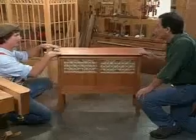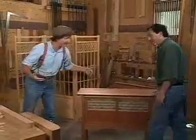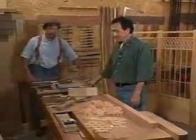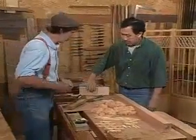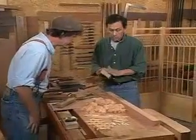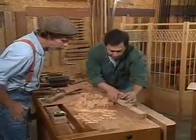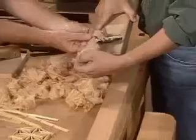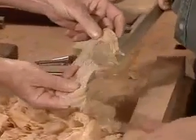Plane. All right, so we're going to achieve this truth in the wood. We've got to see how we get truth in the plane. Okay. So maybe we need to move to the technique. First of all, let's look at the technique once again and how you use the plane. The plane is pulled instead of being pushed. This is set for a very, very fine cut right now. Gosh. That's tremendous. It's like one cell thick. Yeah, that is astounding. It's very thin.